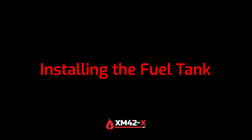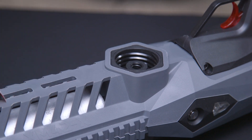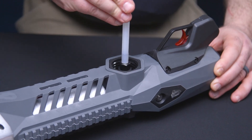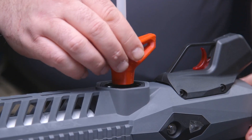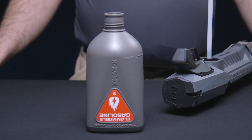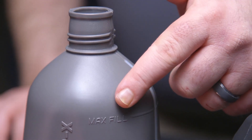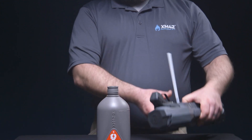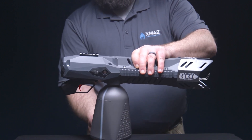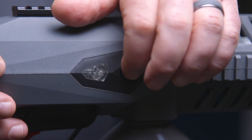Installing the fuel tank. Flip the body of the XM42X with the bottom facing upward and remove the warning sticker. Tighten the dip tube into the fuel manifold, then slide the adapter tool over the dip tube and firmly tighten it into place. Fill your fuel tank with either unleaded gasoline or a gasoline-diesel mixture. Unapproved fuels may not have been tested and could damage the o-ring or fuel pump. Do not fill the fuel tank past the max fill line. With the fuel tank on a solid surface to avoid spills and the dip tube already installed, mount the XM42X body dip tube first into the fuel tank and screw the fuel tank tightly into the fuel manifold. Your XM42X flamethrower is now fully set up and ready for use.